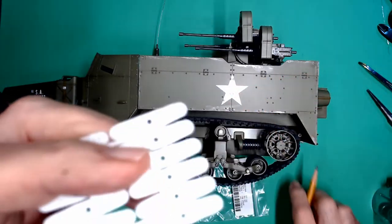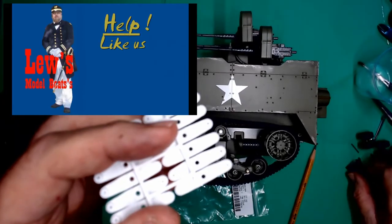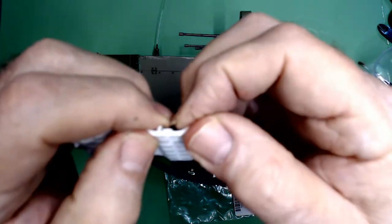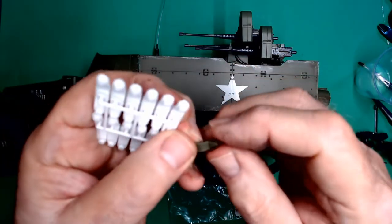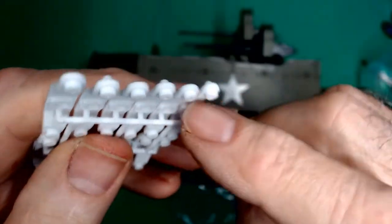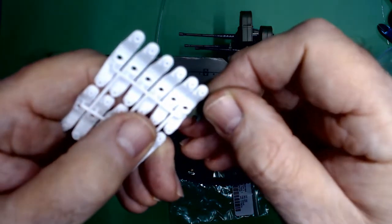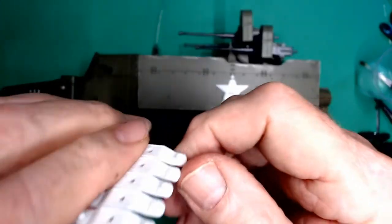I've also boosted the thickness in the back. So this is made out of a pretty tough nylon. And as you can see, I've added what's called a little boss, a little raised area in the middle here that also adds material to that fragile part. So now we have much more material and a tougher material.